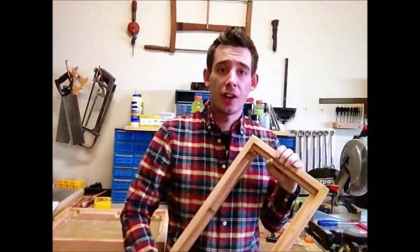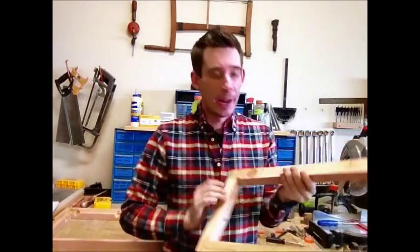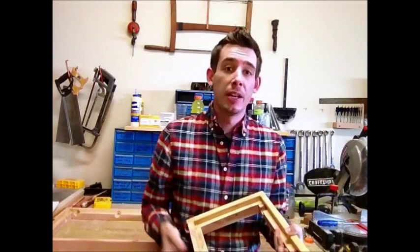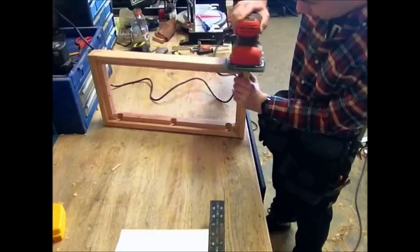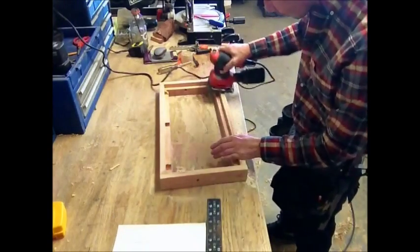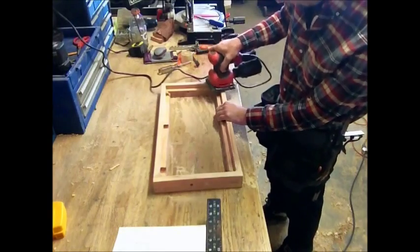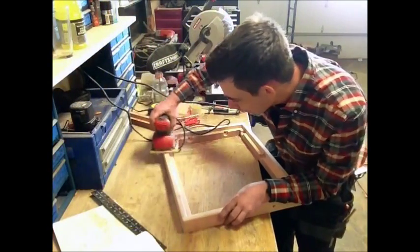I'm going to work on cutting the top panel that's going to fit down into it and be interchangeable. When I secure it from the bottom with screws the top panels can lift out and I'll be able to interchange it for just a regular flat surface, a router table, or anything else. For the finishing I use a random orbital sander, starting with 100 grit sandpaper, then working to 220 grit and finalizing with 320 grit. As I'm sanding I make sure to round over all the edges.